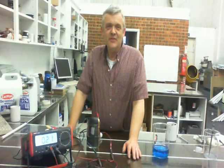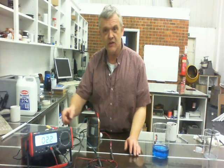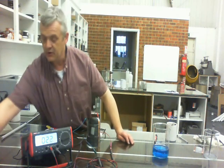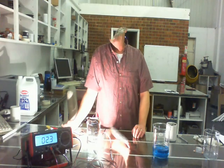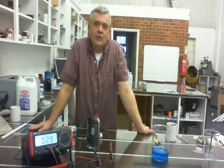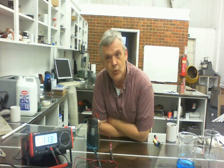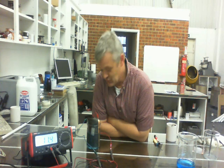So what did you think of that? Isn't that cool? There's a little bit of time lapse required here because it doesn't do it immediately. What I've got here is the copper and aluminium with the carbon ink and a bit of water in it — you can see it's reading 0.21, 0.22. I'm going to plug the light in and leave it for a while. I've left that for a couple of minutes and you can see it's climbed up. Adding the methylene blue has quite an effect on it — it's gone up to 11.1 microamps. I've added about one hundredth of a gram of methyl blue, probably less, and doubled the water, and it's gone up from 2 to 11.3 microamps. It's obviously not just to do with twice the quantity of water — it's gone up five times for adding one one-hundredth of a gram of methyl blue.